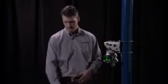And we have a couple of options for initiating that calibration. The most convenient one is simply with a magnet, and that's the one we're going to use here today. You could also initiate calibration with a Hart handheld or by wiring a switch into the terminal block.